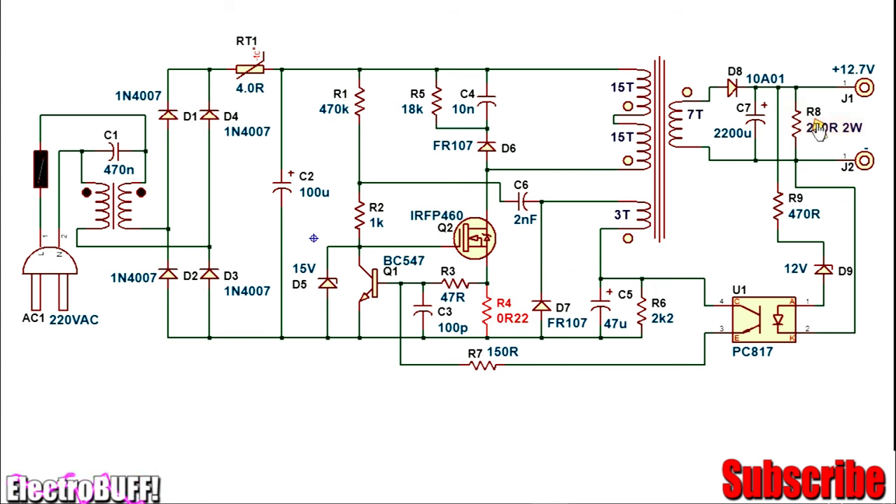In case there is a short circuit or overcurrent draw on the output side, it will cause a much larger current to flow on the primary side. Because resistor R4 is connected across the base and emitter of auxiliary transistor Q1, when about 3 amperes flows through R4, there will be a voltage drop of about 0.65 volts, which will cause Q1 to conduct and connect the gate of MOSFET Q2 to the negative rail, causing it to turn off. This is the current limiting and short circuit protection mechanism — by limiting the primary current draw, you can limit the overall output current or power on the secondary side.